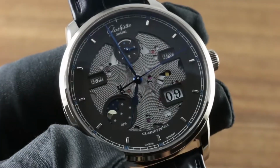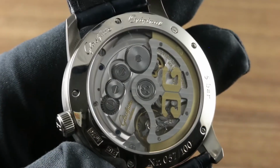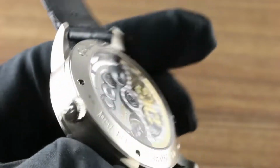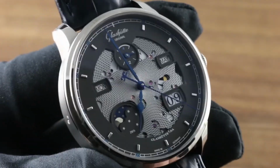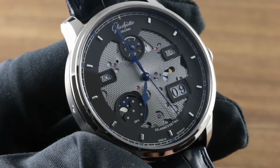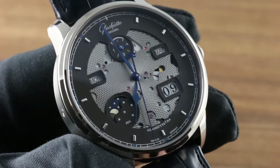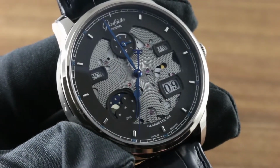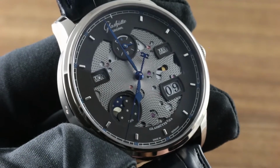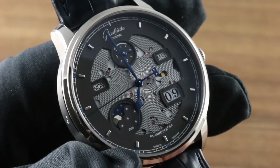It's also important to remember that water resistance is not a static feature of your timepiece. Over time, as seals age and lubricants degrade, your watch will be relatively less water resistant than when it left the factory or the service center. For this reason, it's important to have the watch water tested per Glashütte Original at least every 12 months. A dry test at an authorized service center will determine whether your watch retains its 50-meter rated resistance and capability. This is also a good time to have the total condition of the watch, cosmetic, water-resistant, and chronometric, tested by an authorized service center representative.